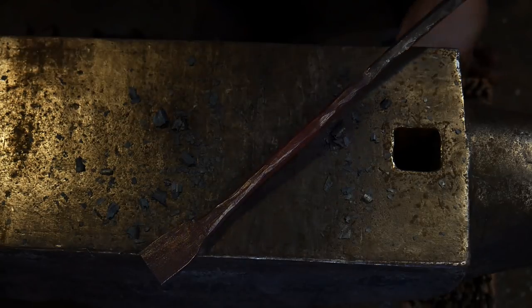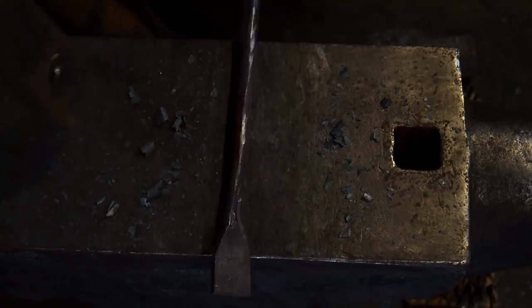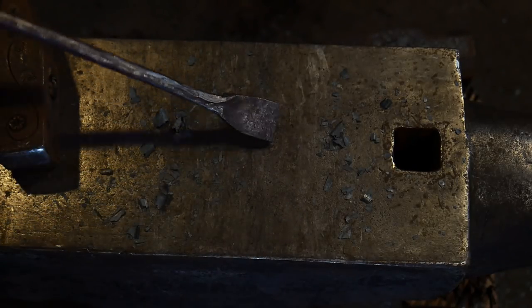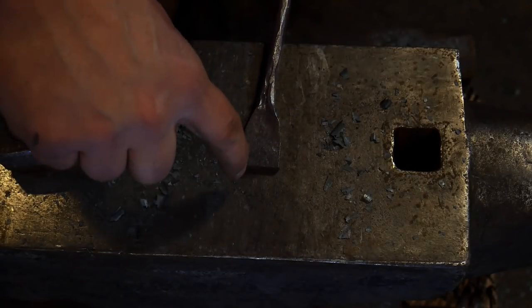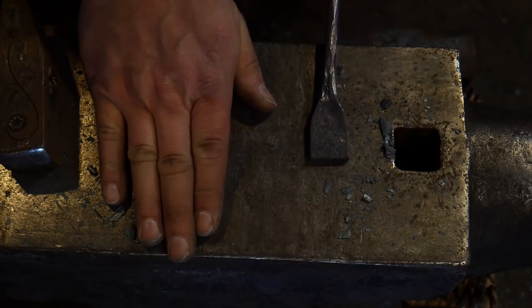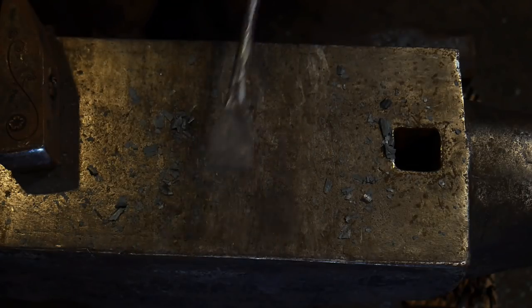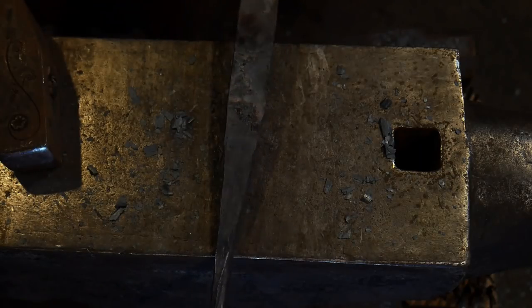Alright, so we've got a pretty good clean here. I'm not going for perfection on the stem portion — you can obviously forge this as round as you like. The ideal was just to create this little foot pad at the end here. So now that we've got this little foot pad, we'll let this cool and go over to the workbench and draw out our fingers for what looks like a hand on the end of this. Then we can start prying out the fingers and working on those — the part that actually makes this a hand. Later on we'll turn the rest of this into a handle, because I'm making myself a little pointer finger.